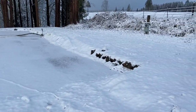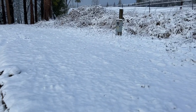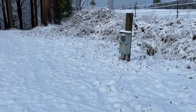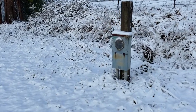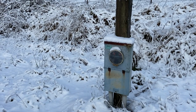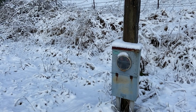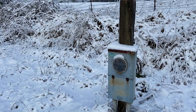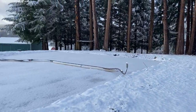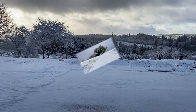I don't think I talked to you yet on video about it, but speaking of electrical, yesterday on our video, this is the box that we're gonna replace. It's an old meter box that they kind of converted to a switch box. And it's already failed once since I bought the property from my mom, we had to repair it. So we're gonna take that out, put a new box in, looking forward to that being pristine and new and clean. So anyway,